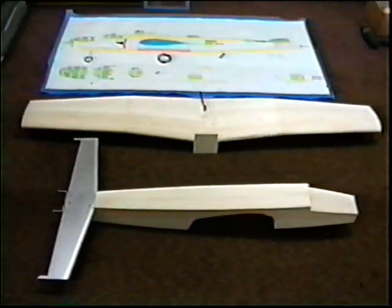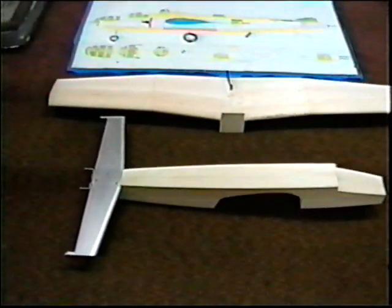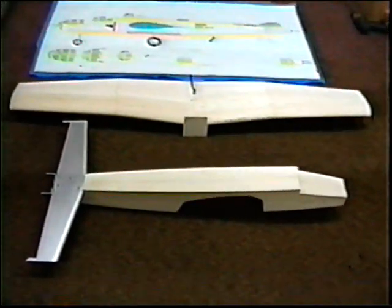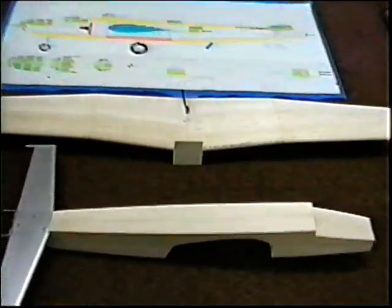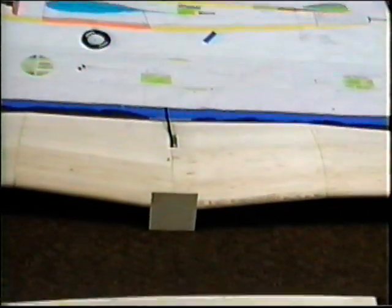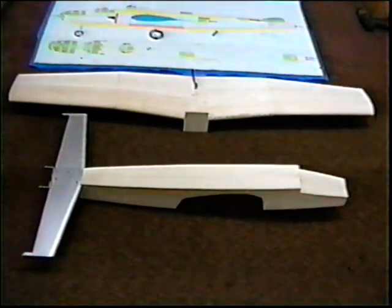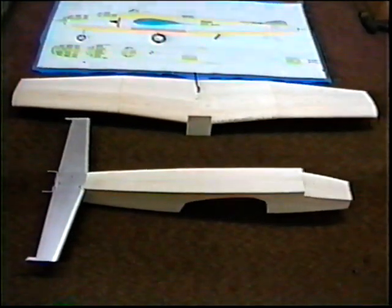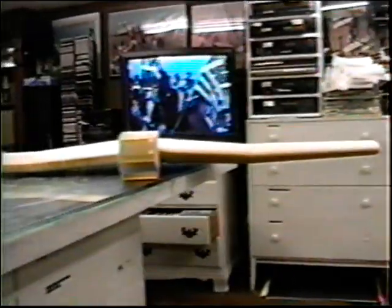Now, after the wing drying up, the next step that I wanted to do, I wanted to put the whole plane, I wanted to put the tail in, bolt it in, bolt the wing in, and check that I have everything in good alignment, because I can still move it. I can still make fine adjustments before I put those permanent little sides on in the front and the back. So after this alignment is checked, and assuming this is going to work out okay, or I spend the minimum time doing this, then I want to get ready for one of the major operations here, and that is to get the glass.